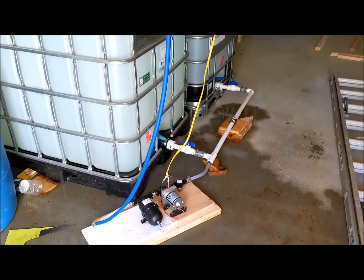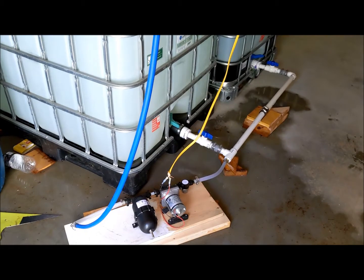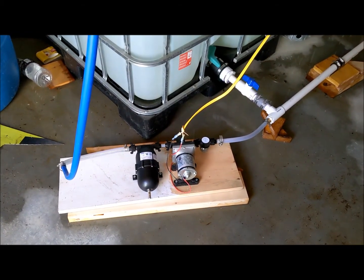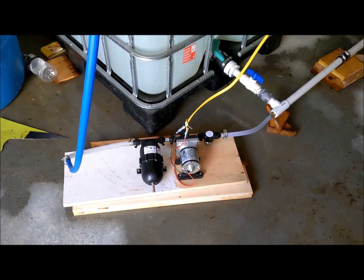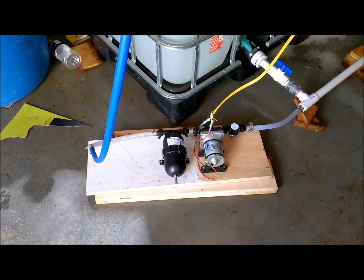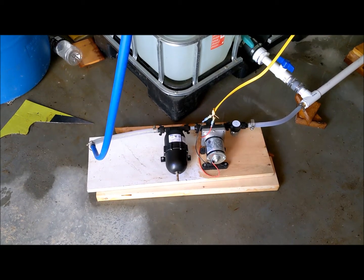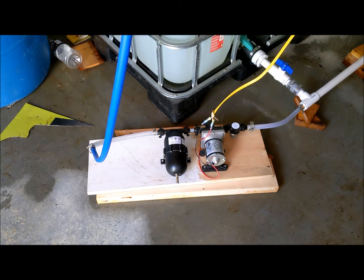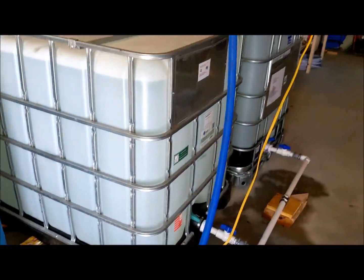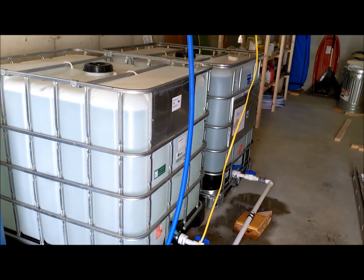This is the finished product. I got my PVC pipes in there connected to the tank, and then I've got a hose running over to the pump. The first little black piece is a strainer, which is new for me, and then into the pump, which I've been using for a year and a half. Next to the left is the accumulator tank, also new for me — I hooked that up yesterday. It's amazing how quiet the pump is now; you don't even know it's on with that accumulator tank. The floor is wet because I filled up the tanks yesterday — I've got 600 gallons total.